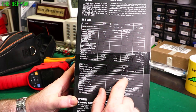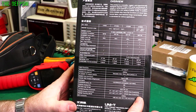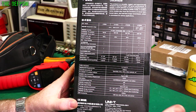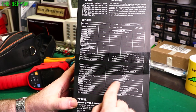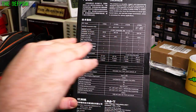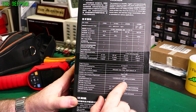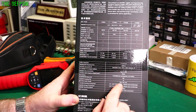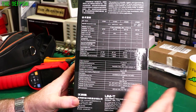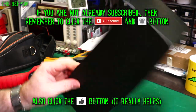Charging voltage is 5V at 2 amps — I did see it pulling 2 amps from my power supply when charging. It's got a 5,000mAh battery and took about 2 hours to charge from roughly 25% full, which makes sense. It tapers down towards the end as you'd expect from a proper charge controller. Battery life is greater than 6 hours, which isn't bad. Image storage is via microSD card, and the quoted charging time is 4 hours from flat.